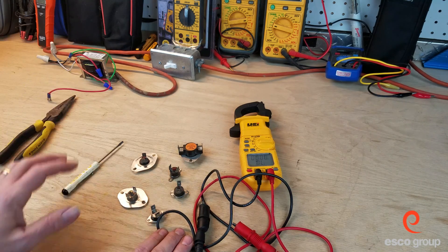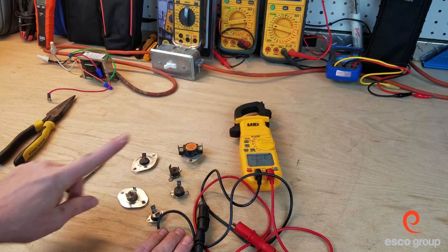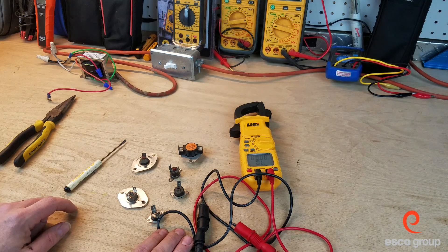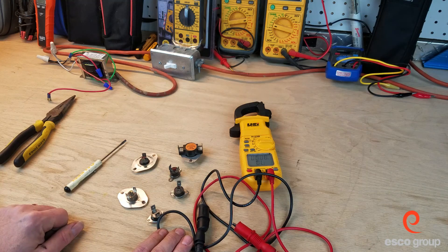You can tell what kind of switch it is by where it's located in the furnace. A rollout switch would be located around the burners. An auxiliary limit switch is typically located in the blower compartment. And a vent or stack switch is near the draft hood or on the flue pipe with an inducer motor type setup.